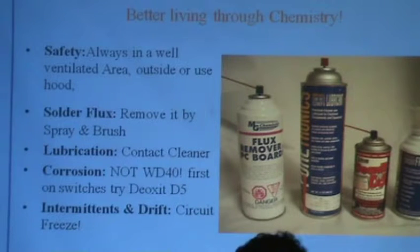Oh, I'll put WD-40 in. Well, I know it'll go nice and smooth for a little bit, but that's not a long-term answer. Intermittents and drifts and stuff like that. Sometimes you can use circuit freezing material like that. You can spray it and cool something down. It'll come back. And that usually is if something works okay, but after a short period of time it quits